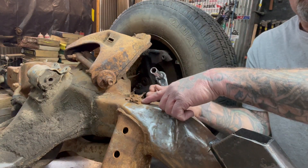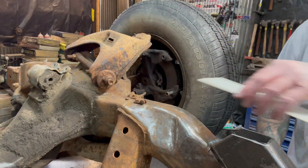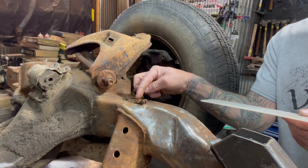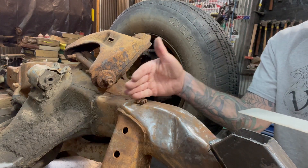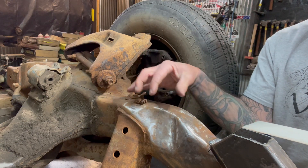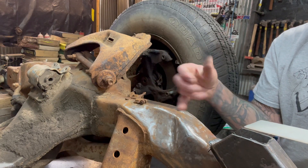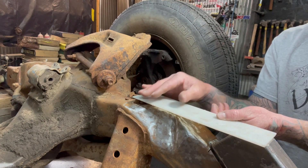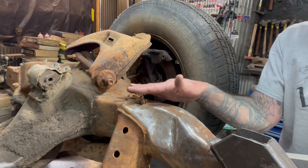The old brake lines are right here — I'm taking those off because they're blocking the piece of metal that's going to go here. I'm going to take a piece of metal from here to here and grind all this down to bare metal because it's surface rusted real bad. That way it's got a clean spot to weld to, and I'm covering up the seam where they put the frame together on these S10 frames so it'll look nice and clean with that transition when it's painted.